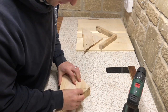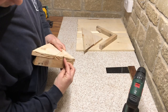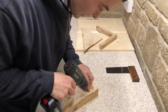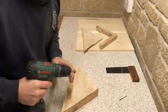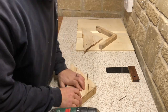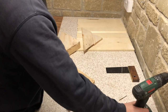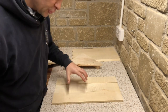I'm using 3.5mm by 40 screws — they should be able to go that far into it. I want to be drilling a 3mm pilot hole because these are 3.5mm screws. I'll just stick a couple of screws in. There we go — second one is doing exactly the same. Once we've got the two shelves on each support, I'll show you how they're going to fit onto here.